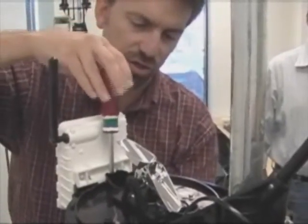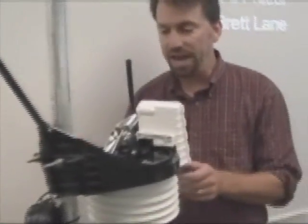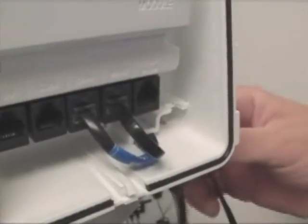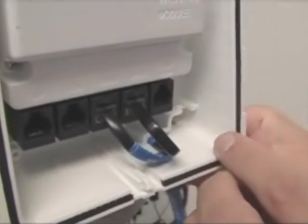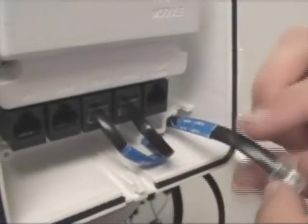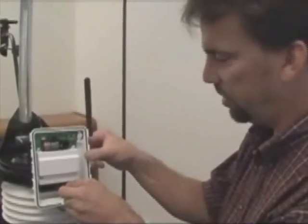Tighten them up enough that it's secure, stable, and doesn't vibrate or isn't loose. To finalize the replacement, take the temperature humidity cable, thread it back through the hole in the back of the shelter — not in the shelter door, back of the shelter. Notice there's a large portion of the cable hole and a small portion; it's easiest to only thread it through the large portion. Plug this back into the temperature humidity port.